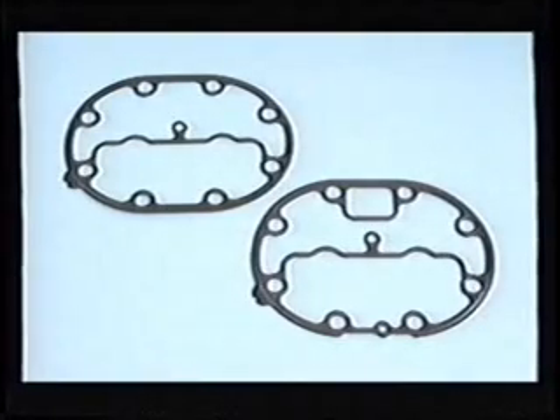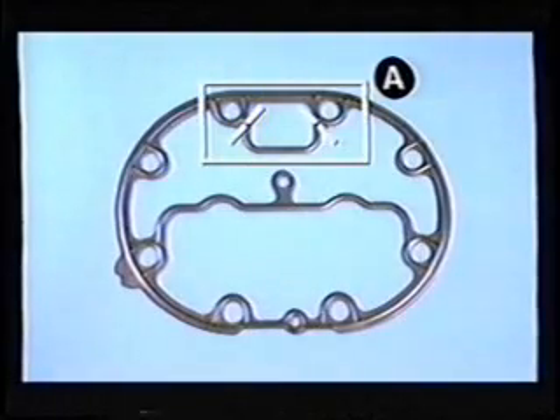The anchoring tab in the center rib positions the center web during assembly and helps to prevent the gasket from blowing out due to liquid slugging. This gasket is provided in all 06E valve plate and valve plate gasket packages. It may be modified to be used with any standard non-unloading cylinder head or can be used as is on cylinder bypass type unloader heads.